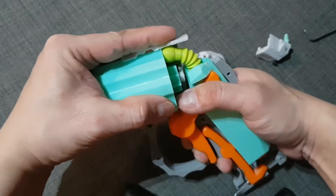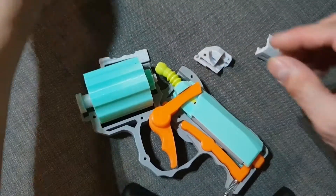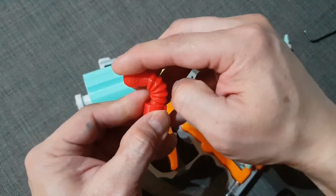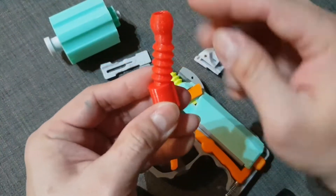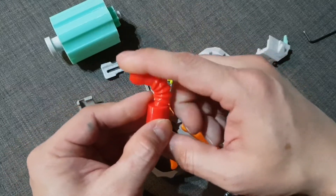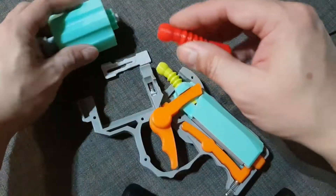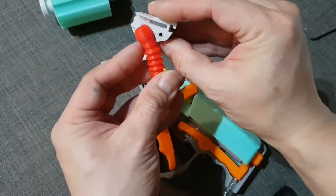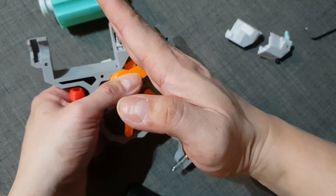Basically it's just like that to create the air seal. The shape of this is not just going to bend, or just going in here to create the air seal. The shape of this also acts as the last push — as a spring. It has two functions: the first one is it's going to detach itself from this, and then push against this, creating a force with a 27-degree angle down here.